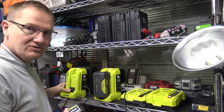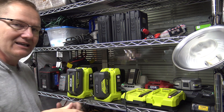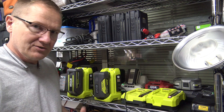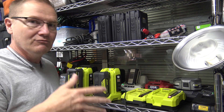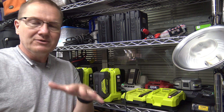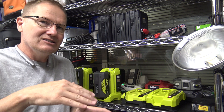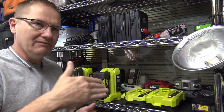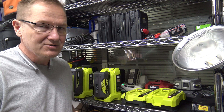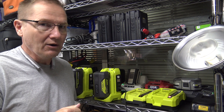For those of you wanting to do coffee makers and things like that, this will not do it — there's just no way. Coffee makers take 800 to 1000 watts; these will not do it. This is going to be for charging cell phones, running computers, or if you're in the entertainment world, running ceremony sound systems. Speakers — if you're not in the music industry, powered speakers you can pick up at any retailer don't really use a lot of power. They'll be pulling about 30 watts of power most of the time, and seldom is a speaker going to be pulling more than 100 watts out of the wall.